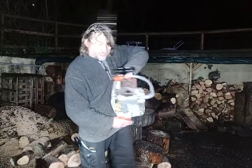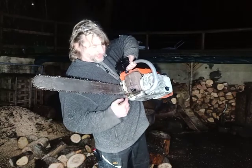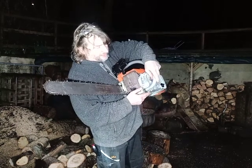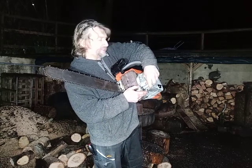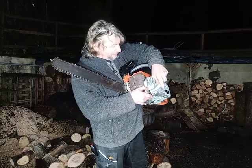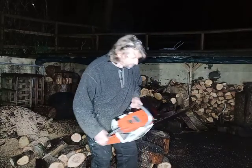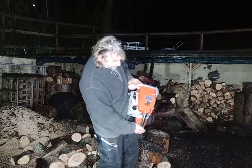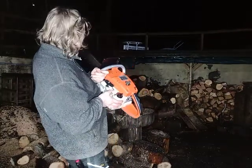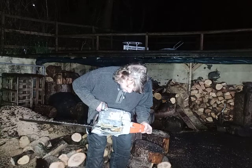Maybe or maybe not. There is a tiny break, which I've only noticed on rechecking recently, on the bottom left-hand corner here, which means that the inside felling spike no longer has a lower mounting lug to mount on. The bottom AV handle mount here is a little loose. I haven't taken it off, but it's in tight and firm, with some movement, so that AV mount is obviously worn. And if I'm hypercritical, there's a little baby chip here off the corner of the fuel tank. I guess that's about it for the main part.